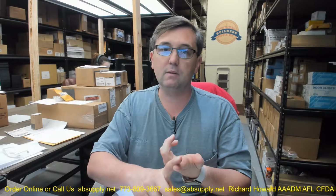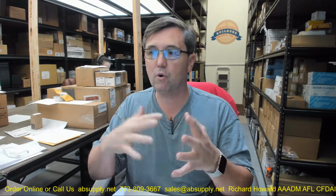However, in the advent of the computer age, the last three decades, codes online, literally codes online, is a more convenient, a bit more portable way to access a code. If I need to cut a code for a master padlock, I would just use codes online because it's so much more capable than a code book of cross-referencing data. You can search by manufacturer, you can search by the key blank, the information on the head of the key blank to cross-reference it.